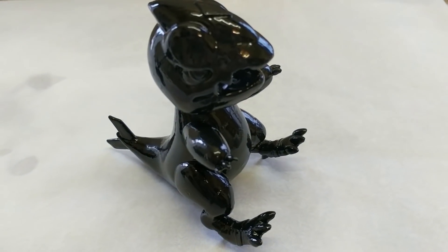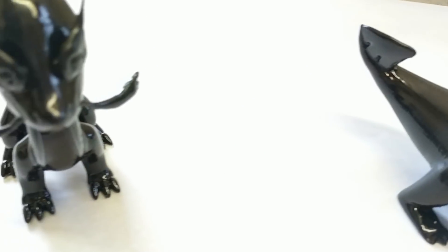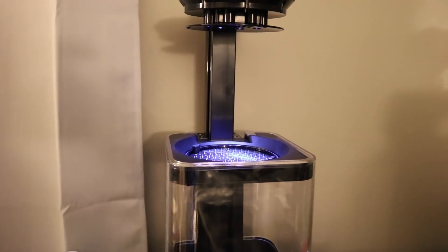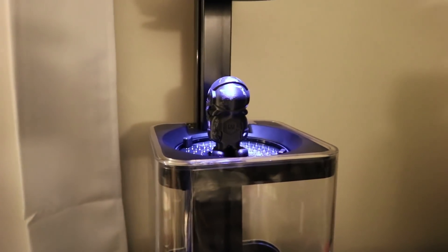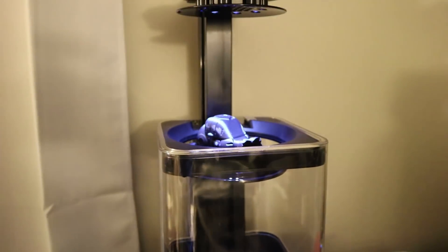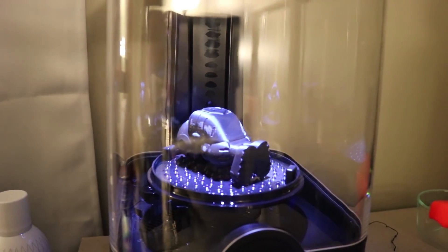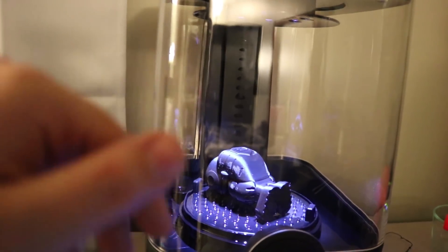Now that you've seen the results, let's talk about my actual review and what I think about this machine. Starting with what I like: the first should be pretty obvious — I love how smooth things look when they come out. Anytime I can make life easier on Chelsea and not force her to sand like crazy on small models, that is absolutely a good thing. Another thing I really like is how easy this machine is to use. The setup was very quick — we just had to install the little nebulizer, pour in some alcohol, and it was pretty much ready to go. All you have to do to polish a model is click a button, the lid rises up, you stick the model on the platform, it goes down, smooths for however long you set, comes back up, and you wait for it to dry. It's also a lot safer than acetone smoothing with ABS.